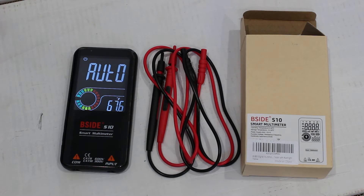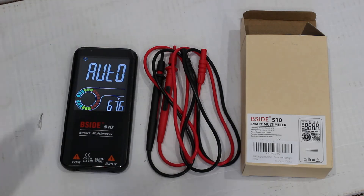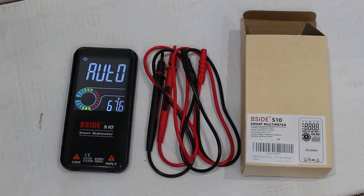So let's talk about what's bad or not so good about this meter. The non-contact voltage sensing is not as sensitive as a dedicated NCV non-contact voltage probe. If you're doing non-contact voltage testing, you've got to hold the top of the meter up to a live wire in order to detect it. At the end of this video, we'll show a demonstration. A dedicated non-contact voltage tester can be held a couple of inches away, but this one has to be held almost on top of the wire.